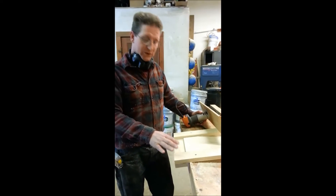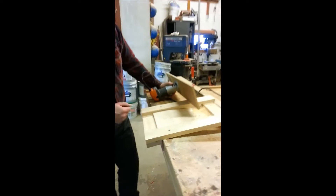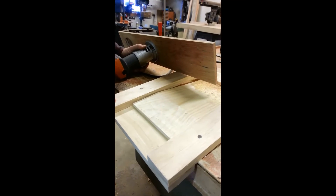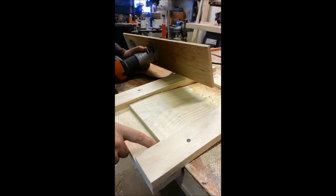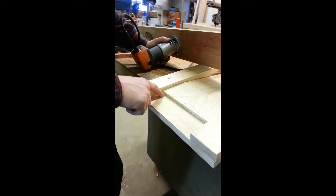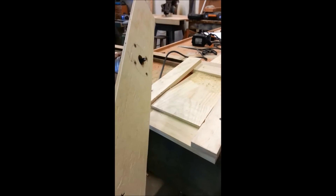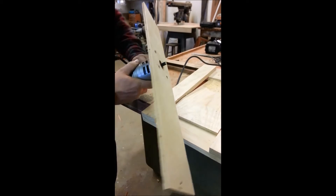I made two passes with the router with the scarfing jig already. You can see how it's taking it down at an angle, so I'm going to lower it a little bit more. I have this set so when my router bit is down to 3 quarters — which is the thickness of this piece — these will go from nothing up to full thickness. We just lower the router a little bit at a time, tighten it back up, and put on our ear protection.